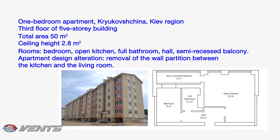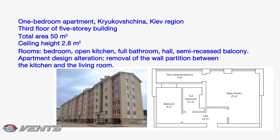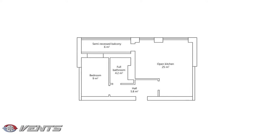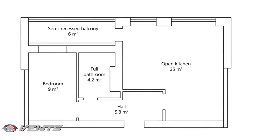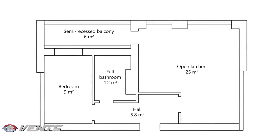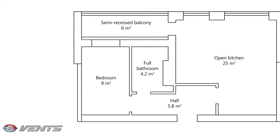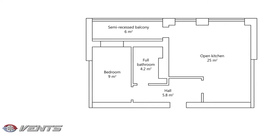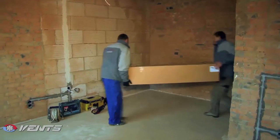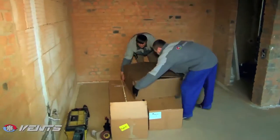Since the bedroom has no exposed walls, opening a window to let in fresh air is not the best solution. The inhabitants intend to spend most of their time in the studio kitchen, which is also expected to be used by large groups of guests in social occasions. The corridor and the glazed balcony have no shortage of fresh air due to the ample supply of transfer air from the main spaces. However, the bathroom needs a solution for removing odors and excess moisture.